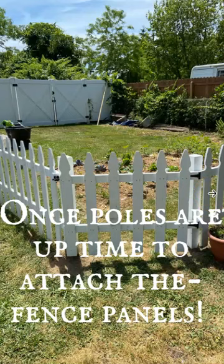Now, the gate was perfect. After a few weeks of the guys coming and mowing the lawn, they knocked it around, and I had not put in a diagonal piece of wood here so it wouldn't sag, and that was a mistake, and I did add that. I don't have a picture of it right here, but I did add that so it wouldn't sag. And it's worked out fairly well. The fence has held up beautifully. It's been over 3 years now. The gate is fine, although every once in a while I do have to make an adjustment.